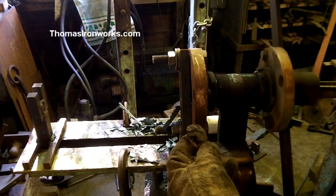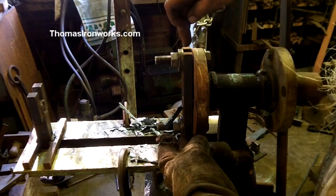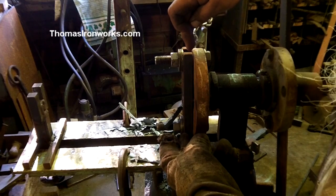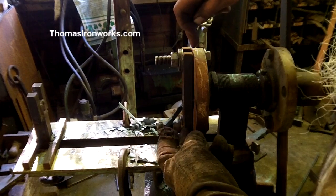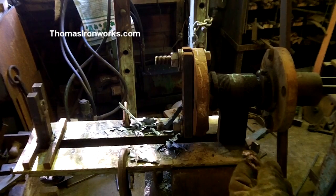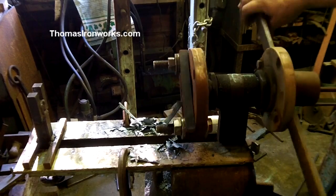And the reason I use flanges like this is so that I could build tooling like this. I have various toolings right now, 5/8, but I have them from quarter all the way up to 1 inch that I can bolt in place. The center is open so the rod can pass through. And then I have a flange back here that I can put my handle to.